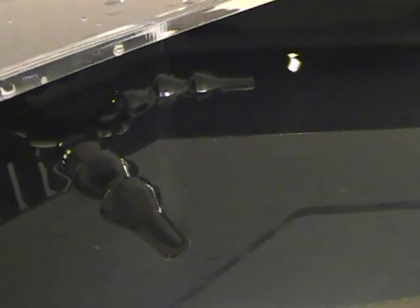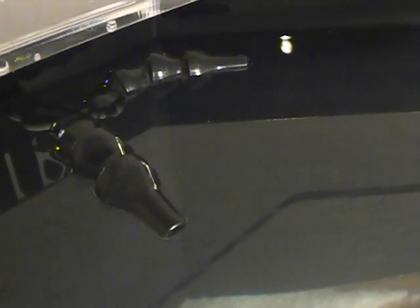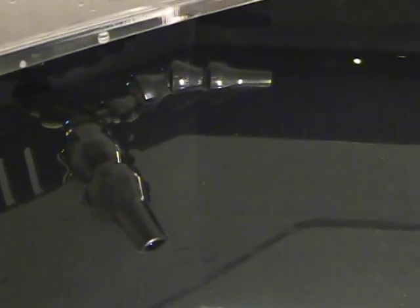So this is the first thing we're going to do — turn the power off and allow all the water to drain down to the bottom of those two return lines. Once they suck air and break the siphon, technically no more water is going to drain from the tank. If my filter below is holding all of that water, and it appears we are within two inches of that point, then I'm safe knowing the maximum amount of water that will drain back to my filter.